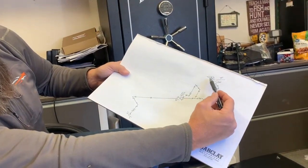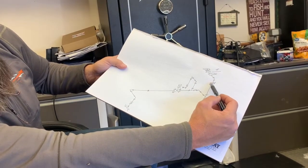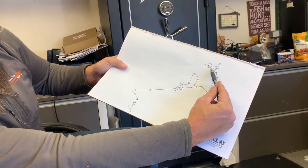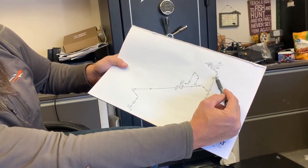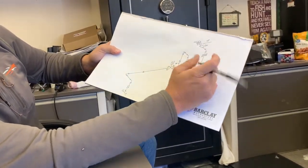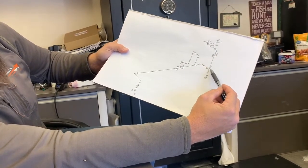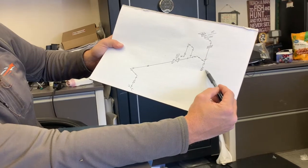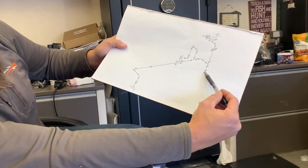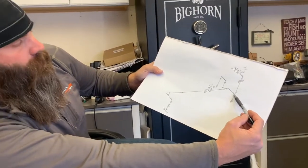Technically this run goes west then drops straight down, running into a set of flanges. As it leaves the flanges, we've gone from threaded to welded — that's why we need the flanges, so we can screw in on one side and be welded the rest of the way through, while still maintaining a break point at the flanges. Then we'll have a low point drain — a drip leg — with a gate valve at the bottom and a plug in it.